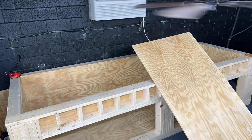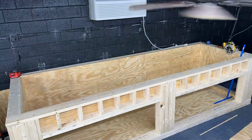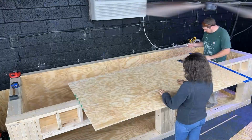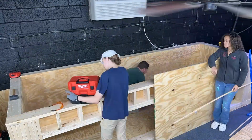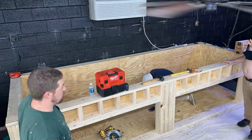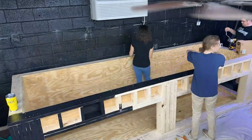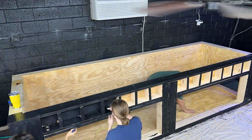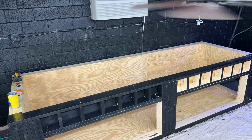We cut the floors of the tank so incredibly tight that we actually had to jump up and down and stomp to wedge that plywood inside the walls. So there is a really nice tight seal already just between the wood floors and the wood on the walls. Also, getting a nice, clean, even coat of either a deck paint or an epoxy on all sides of your wood in the tank build as possible is really important.